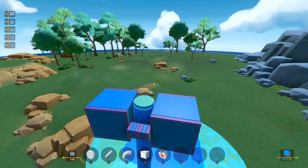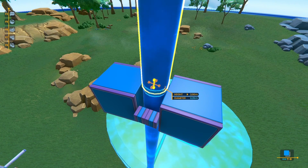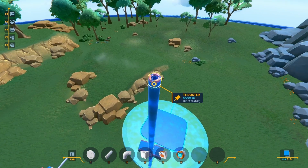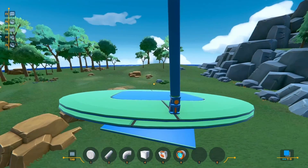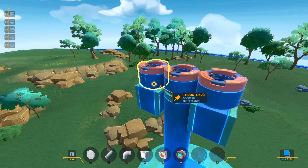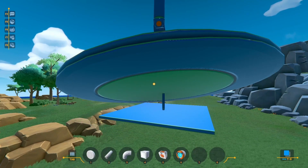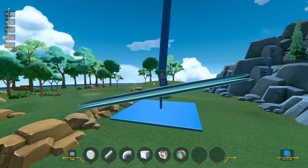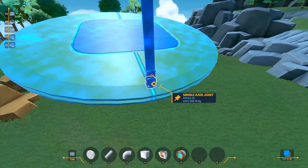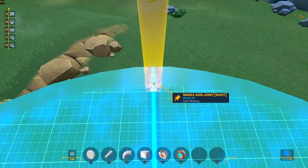I kept the rings fairly loose to avoid too much friction. Testing with a single piston seemed a little weak, so I added more thrusters. Finally, when I turned it on, it moved to the side, and with a small nudge it actually pushed all the way down and started to move. That was an amazing sign — the next thing I wanted to do was get all the other pistons on and see if I could get continuous rotation. Adding them was pretty much copy-paste while making sure all the angles were right, and it actually did rotate around with the disc tilting around.